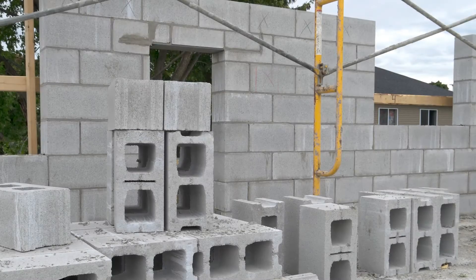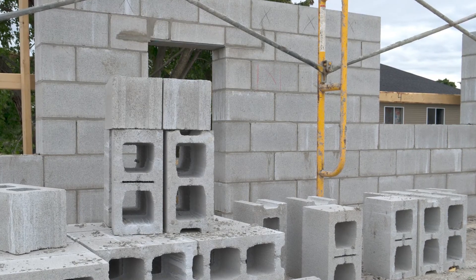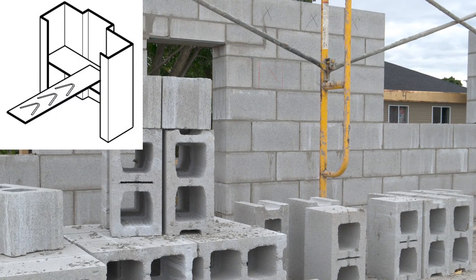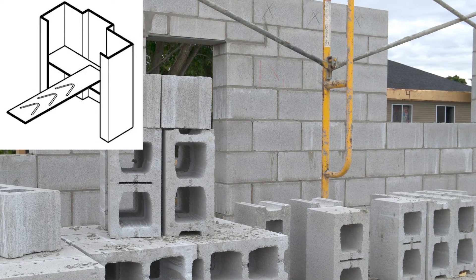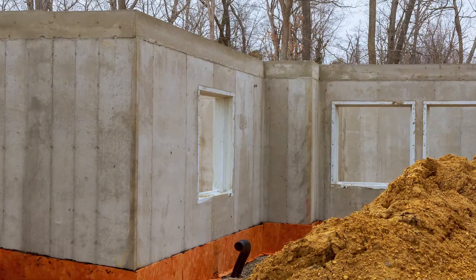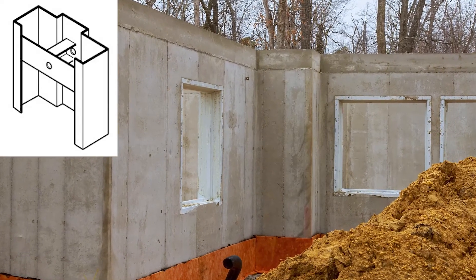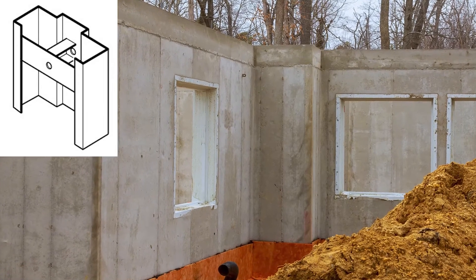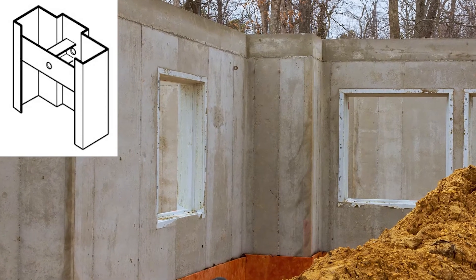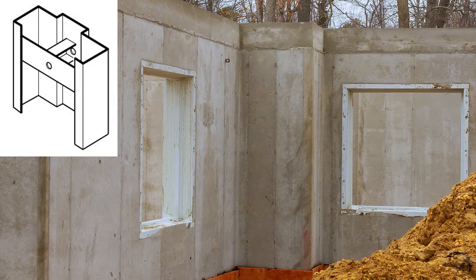The four-sided frame must be anchored to the wall. The type of anchor needed is determined by the construction of the wall. If the frame is being installed as the CMU is being constructed, masonry T-anchors are used. If the frame is being installed in an existing wall — either tilt-up, prefab, or concrete-filled CMU block — tube and strap anchors will be used. Approved bolts will be provided with the frame.